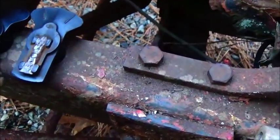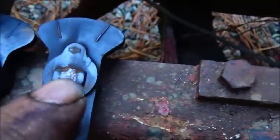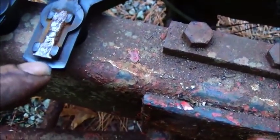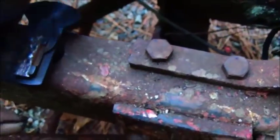Okay, folks, I was just going to clean this one up and use it, but as you can see, it's in rough shape. I found another one in the shop. This one here would have just eaten that carbon right up. There wouldn't be nothing left of it. This one here is probably not the best, but it'll do. Maybe we can get started with that. You can see this is flat on the end from wear and rust, and this one's rounded a little bit to the contour of the distributor cap. So this button is just rotted away.